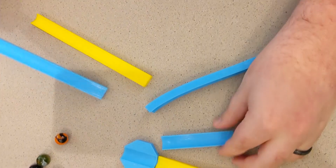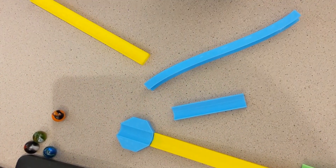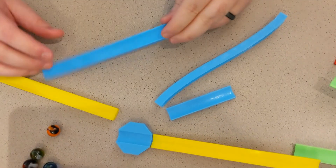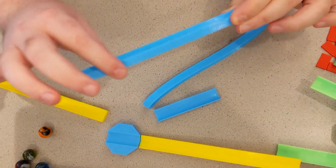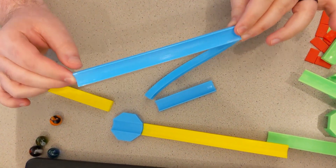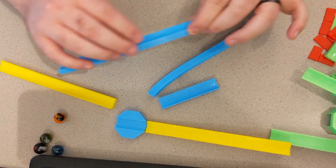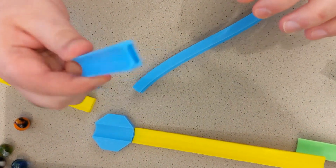The 200 millimeter ones just aren't necessary — you can print two 100 millimeter pieces just as easily and warping is less of an issue. I'll leave the 200mm file in the end results so people with really good bed adhesion can still print them, but for those who don't, just use the 100 millimeter routes.